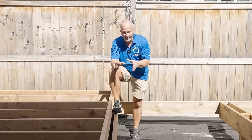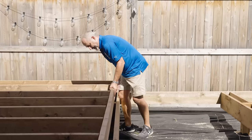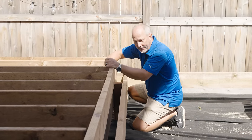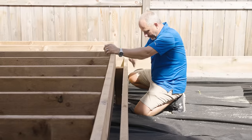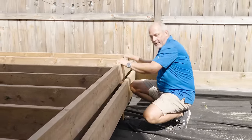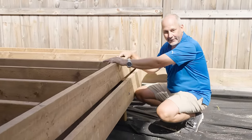One of the reasons I show people how to make the box beam is you can see the mercy that's involved. This entire structure can be slid all the way over here. And as long as each of these joists is a half an inch on top of this 2x10, the load transfer continues all the way through to the post into the ground. So now you can actually measure off the building, put on your triangle, and square off your whole deck on top of the box beams. And then once you've got that where you want it, we can go to the next step.